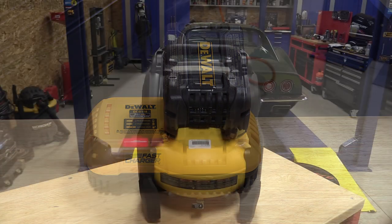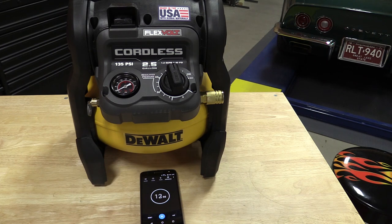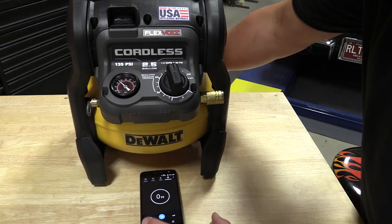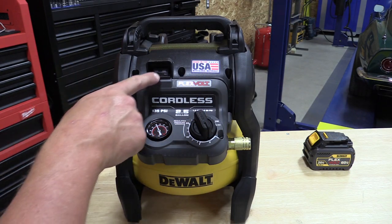After a quick 20-minute break-in and a 30-minute battery charge, we threw a fully charged battery in and tested how long it would take to pump up from zero to 135 PSI — that number ended up being two minutes. It will drain down to 100 PSI, and then it took approximately 23 seconds to recover back to 135 PSI without any use.